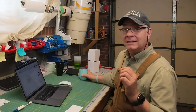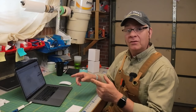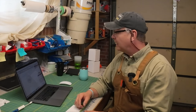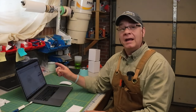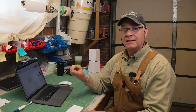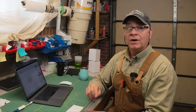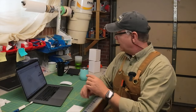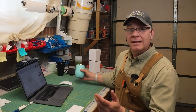I'm gonna go back into the exact same logo. I'm gonna remove the cut layer. I'm gonna set up my rotary for the right diameter, and then we're gonna apply my regular 1.5-inch lens powder coat settings for tumblers. We're gonna burn it once, take that tumbler out and clean it, and then we're gonna switch lenses again, put the 2.5-inch in, and I'm gonna burn a second tumbler. And then we'll take a look at the results and compare.